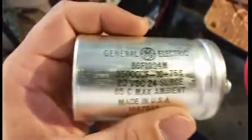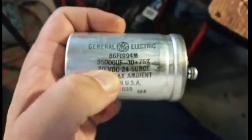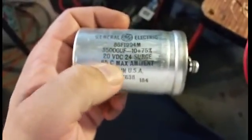So we went ahead and put two new SO-239s on here. I decided it'd be best to just trash this board — maybe take a part or two off it in the future, but just do away with it. We also did away with this isolation transformer — it's just something extra they threw in, taking up space for this particular application. There was actually twice the amount of filter capacitance; just one of these 35,000 microfarad caps is even overkill for what we're doing with two 454s, so we're just going to set one aside.